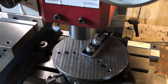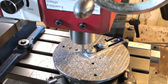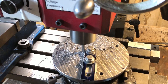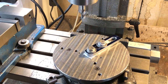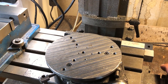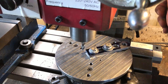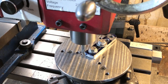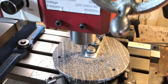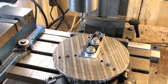If I had thought ahead I would have roughed some of this material off using the sander, but as it's already bolted down now I will just plough on with the end mill. I'm just forming these radii by eye, but if I were to dial it in I would need to remember that when I reduce the width of the part I also reduce the end radius. Same process for the other end — bring the table to zero on the DRO, locate using the pin, and mill by eye. It is worth pointing out that this whole process has been totally overkill, and layout followed by a file or sander would have been perfectly fine. Regardless, that completes the part for now and I can move on to the components that will fit onto it.